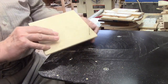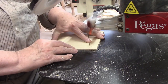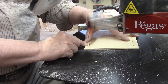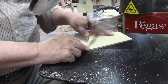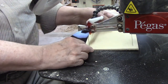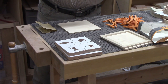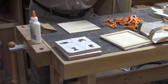The animal puzzles require a frame that the four square pieces will fit into. The plans call for quarter-inch thick material for the frame and the backer behind the frame. It would have been a better look to make the frame and backer from oak to match the puzzle pieces, but I ran out of half-inch thick oak. The frame and backer were a little too wide to consider resawing four-quarter oak in half, then planing it down to one-quarter thick. I had enough quarter-inch plywood on hand to use it for these pieces. It took only a few minutes to cut the square out of the middle that the puzzle pieces would fit into. With the square cut from the middle of the frame, the next step was to glue the frame to a backer, so now there are means to hold the four puzzle pieces in place from both sides as well as the bottom.